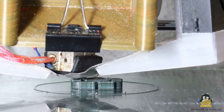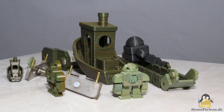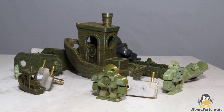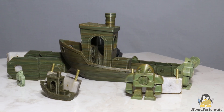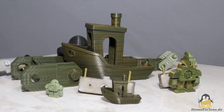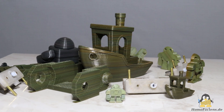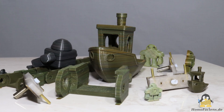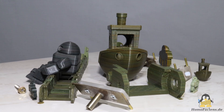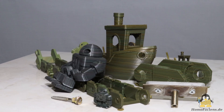I didn't even have to complain about a clogged nozzle. In the days before I drove to Hannover, I printed some PLA parts for the Maker Faire using this configuration and I didn't encounter any problems. All of the parts shown here were printed with the Teflon inserts. I only had to replace it once — on the large Benchy, upon closer inspection, you can see small gaps in the upper part of the cabin, which prompted me to replace one tube. In addition to mechanical wear, the temperature limit of the Teflon insert is a problem that I'll address next.